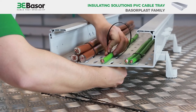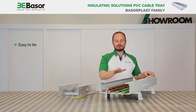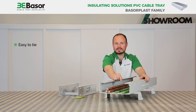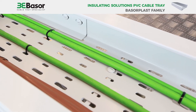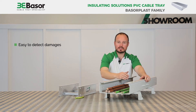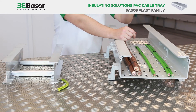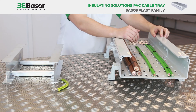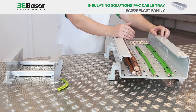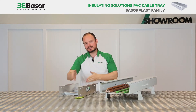Another advantage of the PVC cable tray is the ease of tying cables. It is very easy to tie, and we can fix the cables every one inch transversely or three inches longitudinally. In addition, detection of damage and maintenance of the installation is very easy. The space between cables is easy to manage, and the tray is flat, so it's easier to install and keep cables straight without wavy forms.